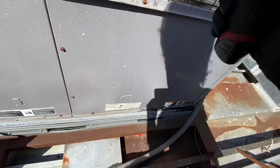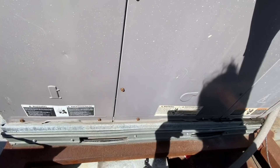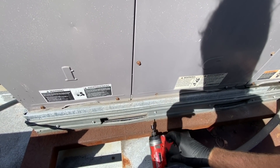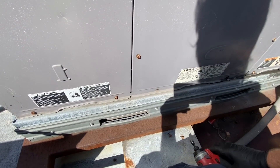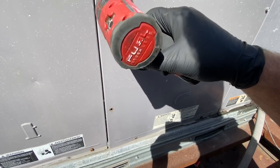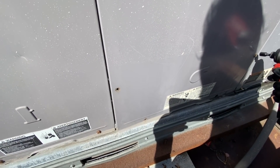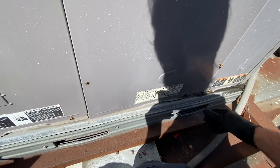The capacitor is a dual capacitor on this unit, so I just went ahead and got one. That way it'll be almost kind of like maintenance - the compressor will get a fresh one, and then you get one for the condenser fan motor. That capacitor is located in here in the blower section, and they stuff it way back here. I do have the power off - you always want to start with the power off.